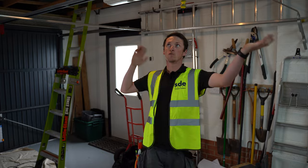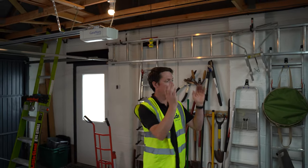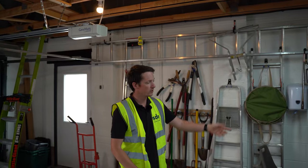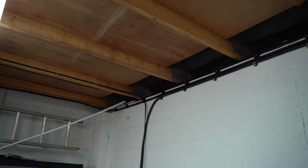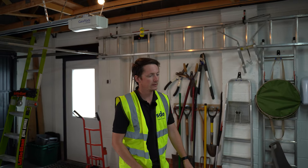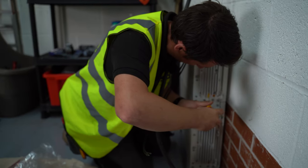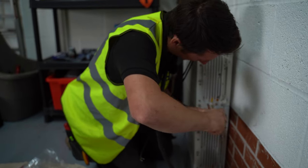In this instance we've got two roofs — a west and east split — so we're going to have nine panels on the west and nine panels on the east. We've essentially got to run two lots of DC cables for this one. We've got the front nine in now, we're going to get the back nine in, and then I'll start stacking the batteries and get the inverter all put in.